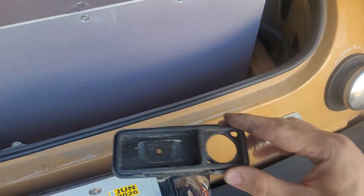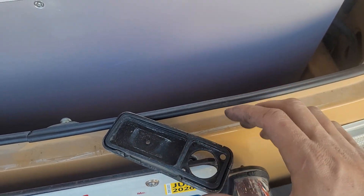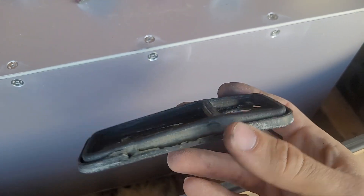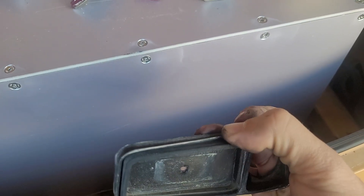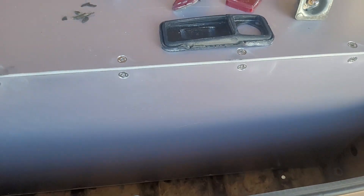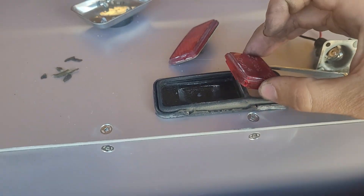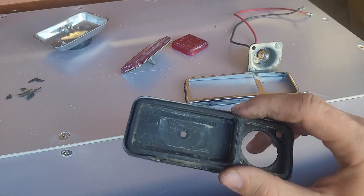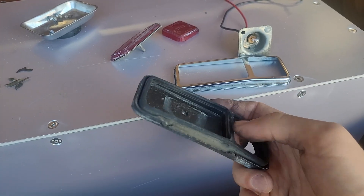Here it is disassembled. It's so old that it's like turning to soot on my fingers. But looking at this more closely, it's actually kind of complex. There are a number of overhanging features like here and here and all around the edge — it's hard to see but it's overhanging. That's so it can trap this lip here and the lips of the lenses. So it makes sense why these are so expensive — this isn't something you can easily mold with all these overhangs.